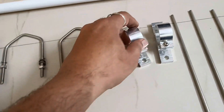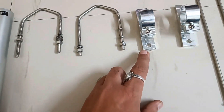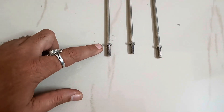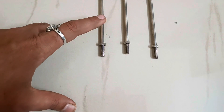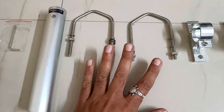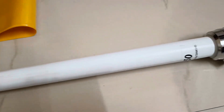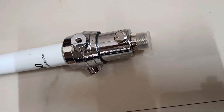There are three radials which have nuts, and these are made up of stainless steel. All these items are made up of stainless steel except the clamps, which are aluminum. At the base of the antenna there is a UHF female connector, and you need to use a male connector either with RG-213 or LM-400 based on your needs.